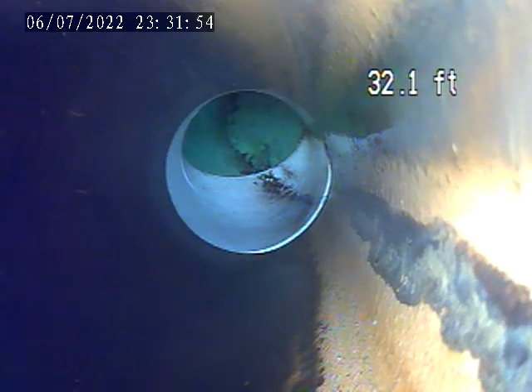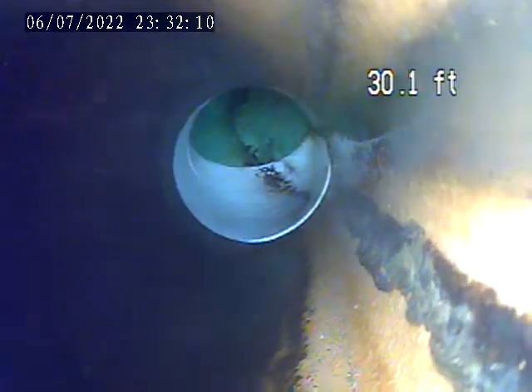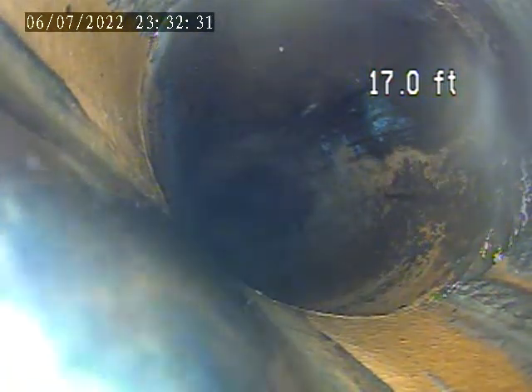150 lands, down July 6th. This is our second video. We're locating this pipe where it sags. We marked it up to this plastic — probably tie onto that for our repairs. Go back about five feet and that's where the sag starts. About ten feet past it, the pipe definitely drops down here. This continues all the way back to the trap.